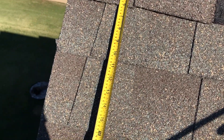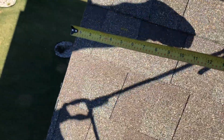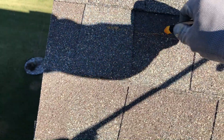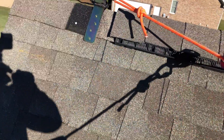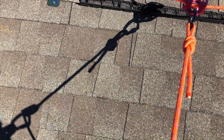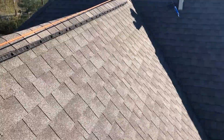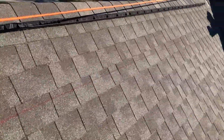I'm going to come down from the top — my first row is going to be about 12 inches from the top, then I'm coming five inches from the edge. After you have marked off where the top of the panel goes, you will need to come down 9 or 15 inches depending on which way the panels are mounting. This is because of the offset of the bolt to the rail clamp.